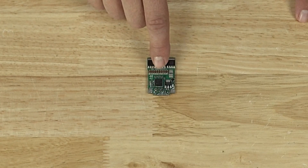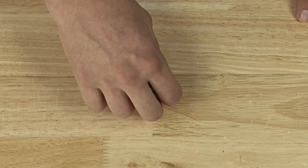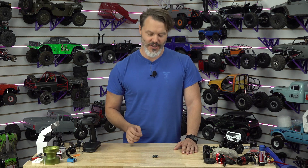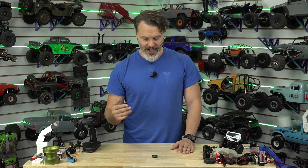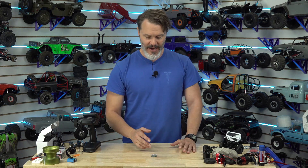What we're talking about today is the Crawlmaster HV. This is going to be the replacement for the Crawlmaster V2. You can see it's exactly the same pretty much, but it has a higher voltage range and some other hardware tweaks that we did to make it much smoother. So this guy has these huge MOSFETs in here. It is what most would consider an 80 amp controller. These MOSFETs are actually 120 amp MOSFETs, but it does not have a heat sink, so what we call it is essentially a 30 amp unit — and that's without any cooling except for your wires coming off.